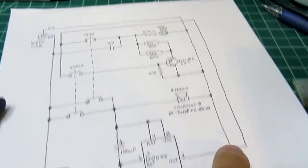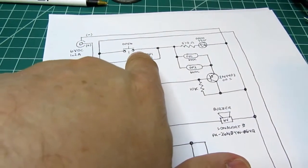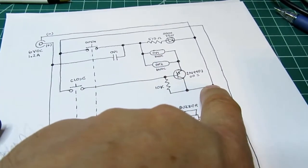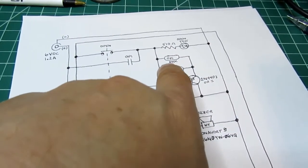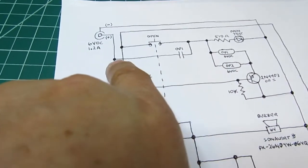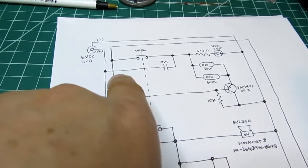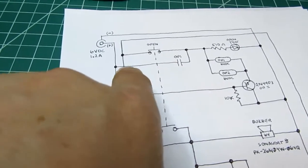Some seconds later, pin 3 turns on, and it energizes this switch. So now, current can go through here and to the relay, and the current through the relay returns to the common supply rail here through the PNP transistor. The coil energizes, it closes its own contact, which is tied to the unswitched V plus rail, or positive supply rail. The reason it's tied there is you don't want it to be dependent on the 555 timer. You want it to be locked in regardless of what the 555 does. So that's why it goes all the way over here.